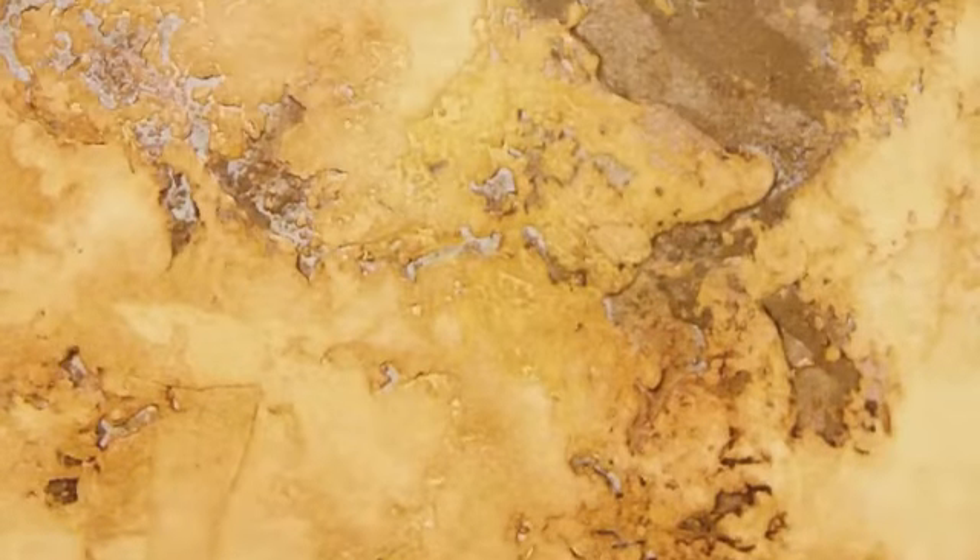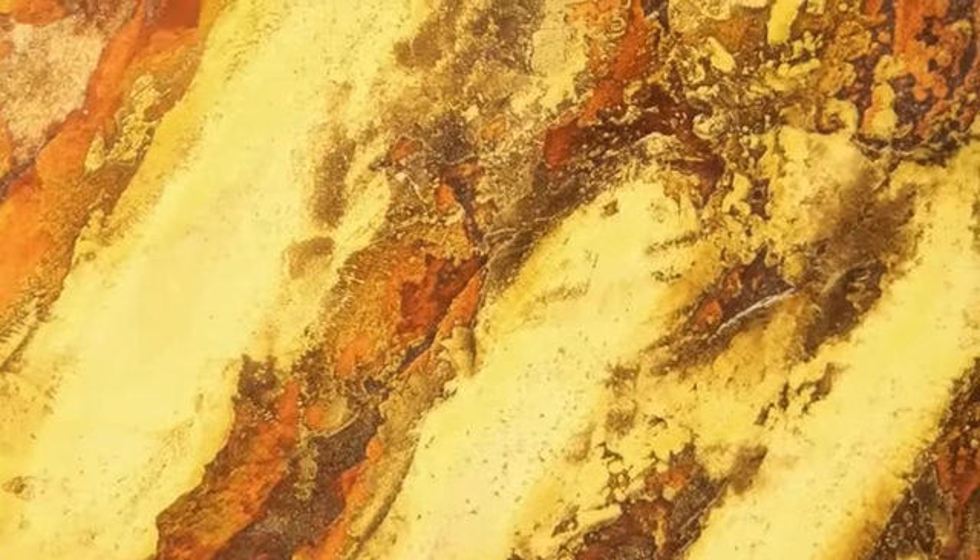Different colors of plaster can be combined. Endless coats of Veneziano can be applied, revealing more depth, texture, and translucence. Veneziano can be applied on top of two coats of Marmorino or Stucco, revealing rougher and deeper base coats while having a mostly smooth or burnished topcoat.